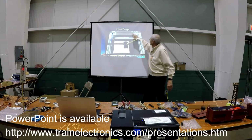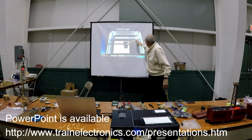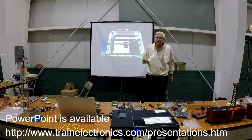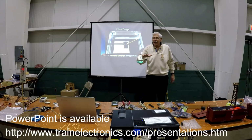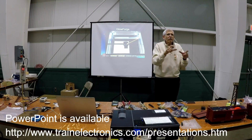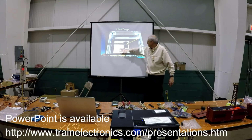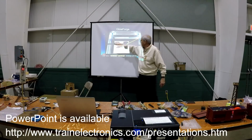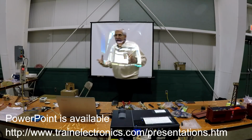This is the laser tube, a glass tube at the back in there. This yellow arrow is pointing to a camera. When you close the lid, it scans what's in there and gives you a picture of what you put in there. And you can move your work around and put it wherever you want. Did that make sense? This is a piece of plexiglass with white covering on it, and I already cut this out. So it's taking a picture and I can say, oh, I need to put my work over here. Or I need to turn it and put it down here, which you can't do with the other one.